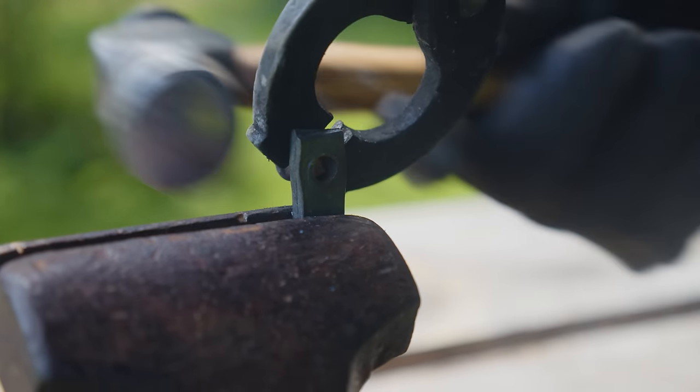Another really fun trick you can use with these: a lot of wood carvers of the time period were carving fans, just a decorative fan carved into the front of chests of drawers and blanket chests. And to do that, we start with a parallel line, and we'll go roughly right in the center where we want our fan to be, and we'll adjust these out to the larger radius. We'll bring these crossed. Now we have our outside radius exactly half, and we can bring these back down for the button on the center of the fan, like that. Now we have our two radiuses.